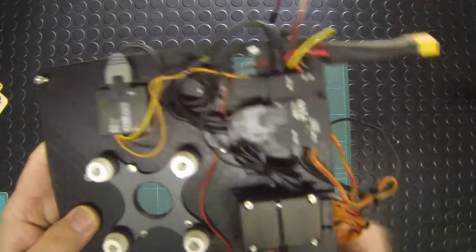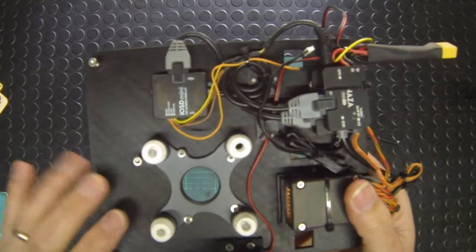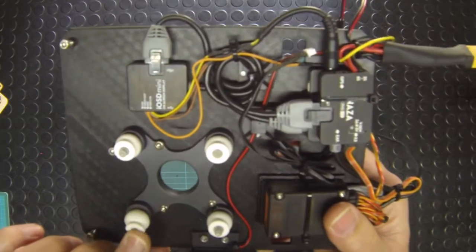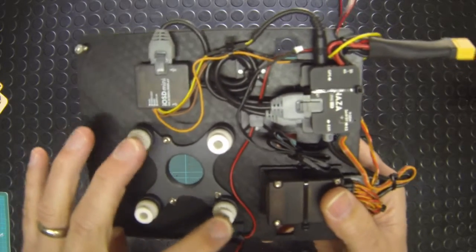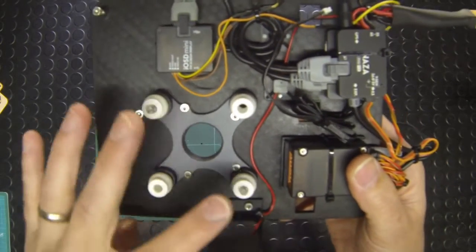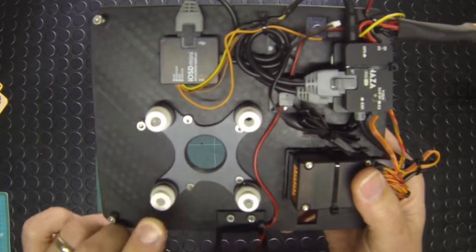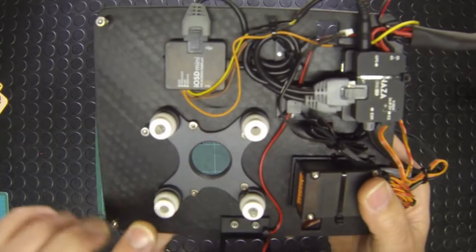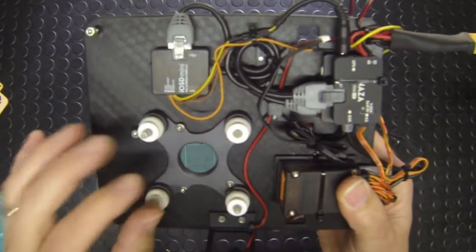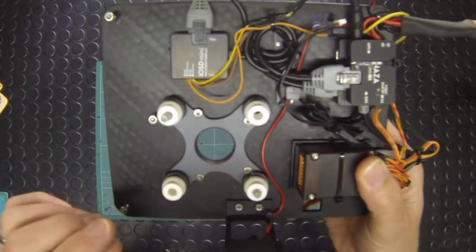Finally you've got the gimbal mount itself — four screws hold it on through the tray. You've got your white grommets, which are fitted as standard, and two retaining clips. When you first fit your gimbal we would advise that you don't connect the retaining clips — do a couple of test flights first, as you may want to swap the grommets for different ones. The gimbal package comes with another two sets of grommets of different strengths, so you may need to fine-tune and adjust.